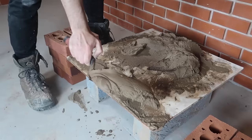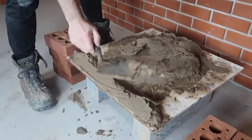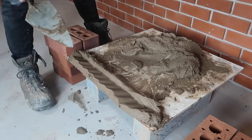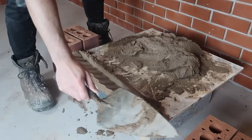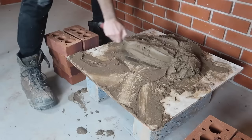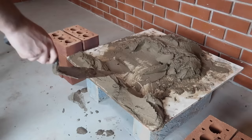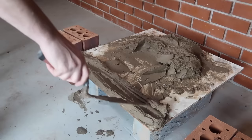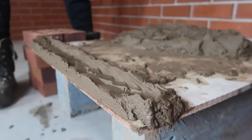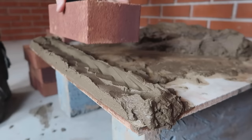So that's the way we do our bed. Create that Toblerone first — nice and even, nice and uniform. We've got our trowel parallel, then at 45 degrees, and it's just keeping the furrow in the top line of the Toblerone, pushing down and then back. Then we're scraping off and collecting — scrape it off and collecting. We want it in line with that face. There's another way you can do it with less furrowing — from the side using a figure-of-eight motion, so it's just a gentle furrow. You're still pushing everything to the face side. We've got a nice bed of mortar there, so that when we put our brick down we can just cut it off. And we've got a nice full bed.